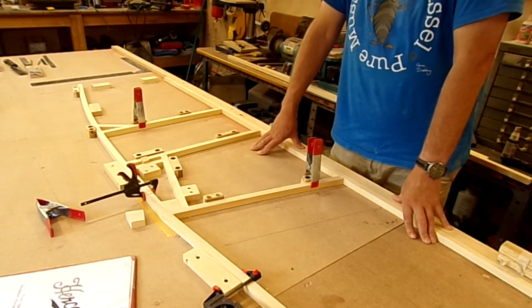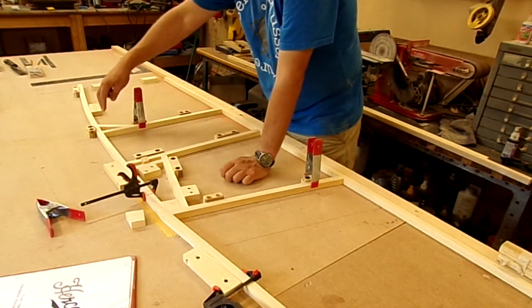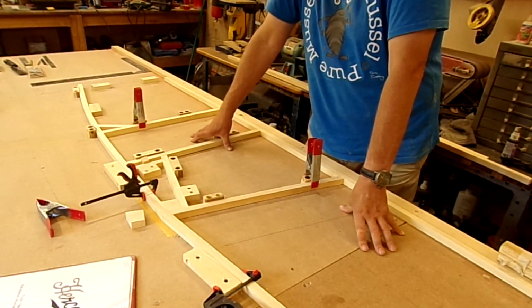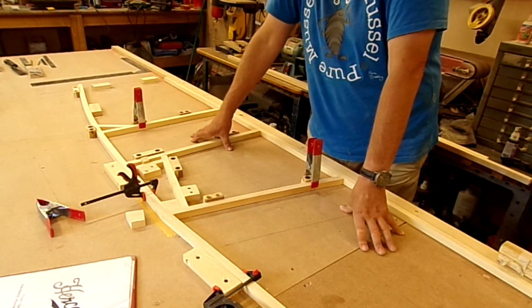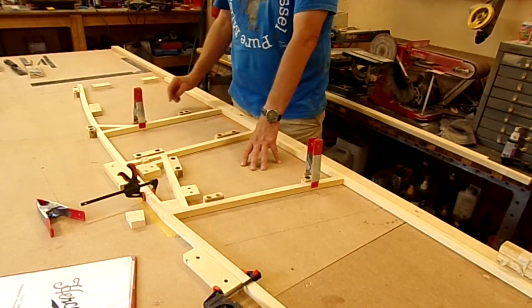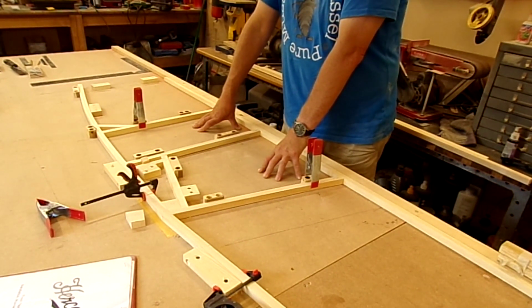Been looking at the undercarriage and scratching my head a little bit. It looks like the U channels bolt through the longeron, so I'll have to ask online if that's the way it goes. That would be quite interesting to see if it does. If it does, it's quite chunky holes going through the longeron, so I'd probably end up putting a beefing section on the sides just to help carry the stress through, so it doesn't have that extra localized strain and stress.